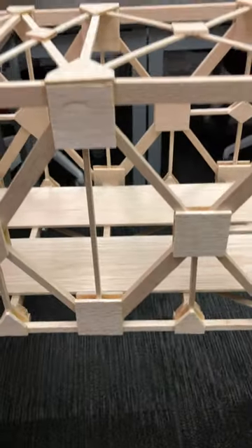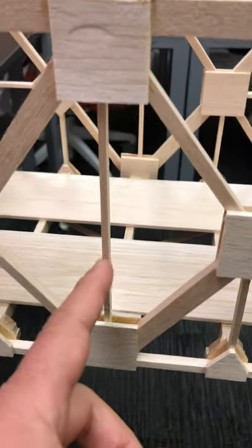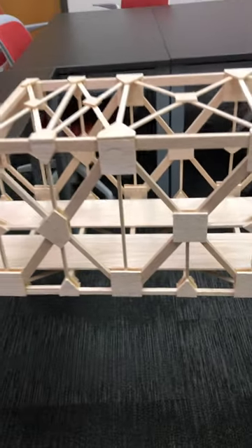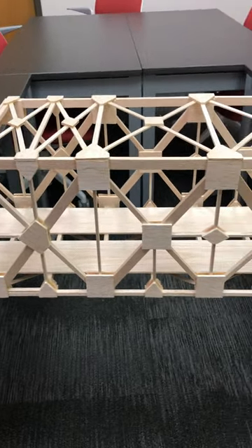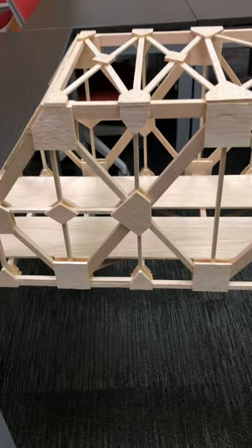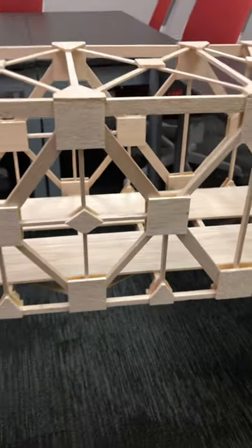The smaller members are those that turned blue when you run the computer code, which means they are in tension. You can see the compression members versus tension members, and some tension members are smaller than others — you get that information from the computer software used to design your bridge. The bottom chord is in tension but it's a good idea to make it slightly bigger than a normal tension member, because you're relying on it to transfer the load from the floor to the truss through the joints.